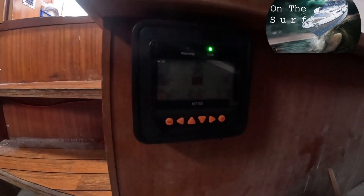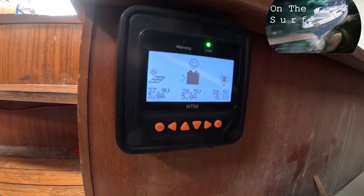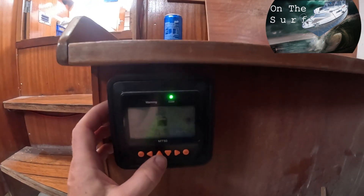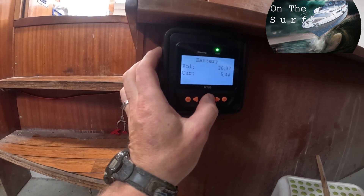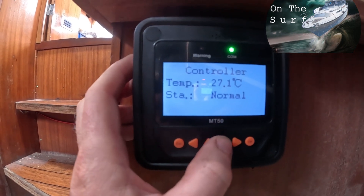It works great, just as I wanted. The batteries are still about full — about 95 percent — when it turns off, and then it turns on again. Today it's a bit cloudy, so the solar is putting in 145 watts right now and the load is 260 watts — so negative 5 amps when it's running. But it works great just as it's supposed to: it turns off when the batteries are down to 85-90% and turns on when they're full.